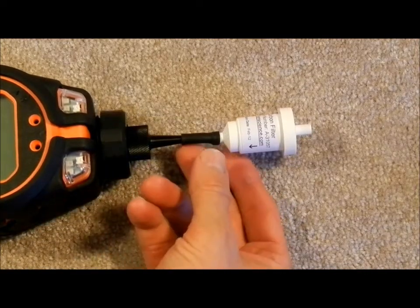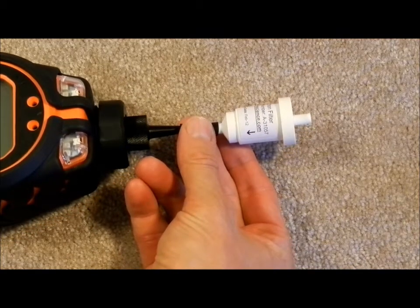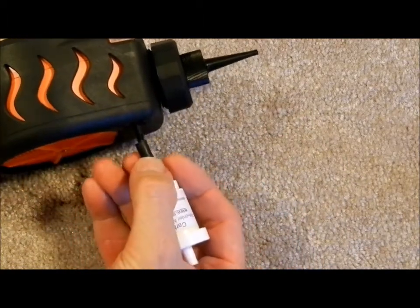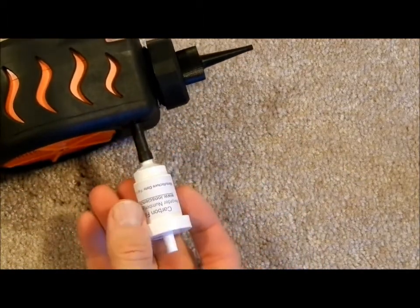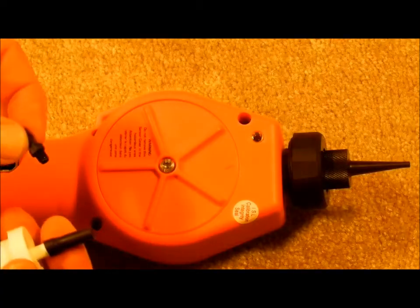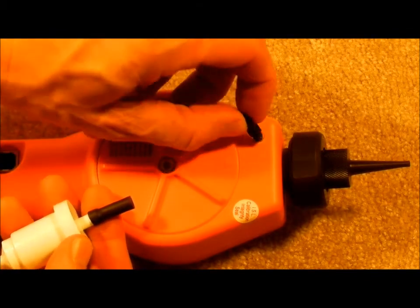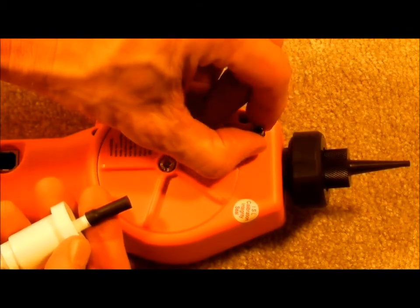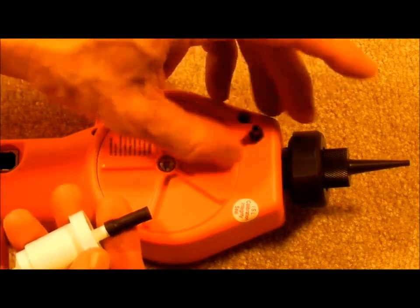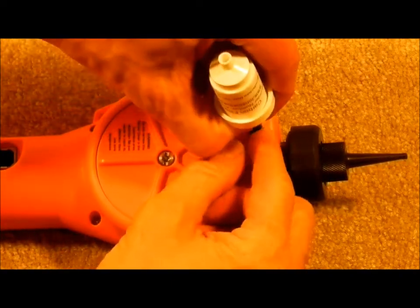The carbon filter is usually attached to the inlet of the instrument to clean the ambient air during zero calibration, or it may be attached to the effluent hose barb to absorb vapors such as benzene during calibration so that they do not escape into the air that you are breathing. To connect the carbon filter to the effluent, use a special hose barb which is not included in the accessory kit but needs to be ordered separately. Screw it into the effluent on the back of the instrument and attach the carbon filter through connecting tubing.